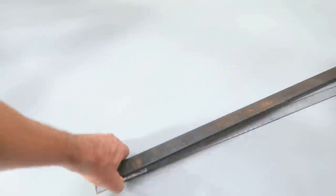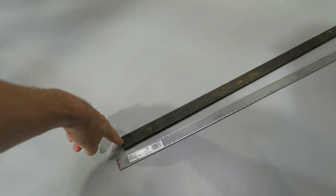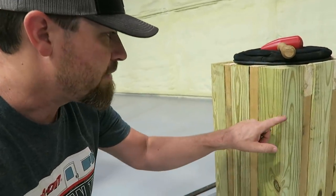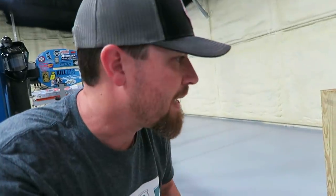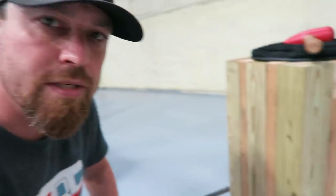So as far as the metal goes, I'm gonna use this. I think it's like 1¼ by probably 3/8. And I think what I wanna do is bend it in tabs or in sections and then have it to where it bolts together. I can probably just show you, but have it wrap around, come up, have a tab on it, and then have this one come down, wrap around, have a tab on it, and then put a bolt in the middle. I can sandwich this whole thing together really tight, and it is screwed together, but if it looks like that's what's holding it together, I think that'll fit the idea of this plan, like that strap is holding this whole thing together.